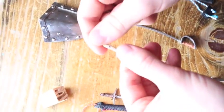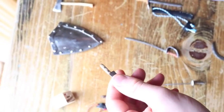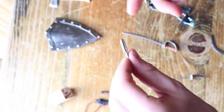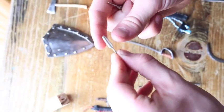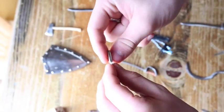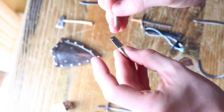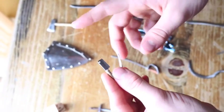So I made all those knives with the block — there's only two. The cleaver goes in like that, and the chef knife goes in like that. These handles right here are popsicle sticks. I drilled holes in the metal, put spokes through the holes, then drilled the holes in the popsicle sticks in the exact same spots and used hot glue in the middle. It didn't squish together right, but when I was grinding the sides it melted the glue and it actually got a really good fit.